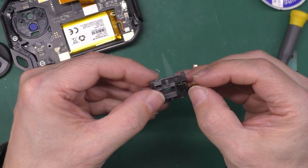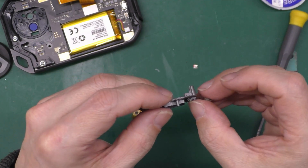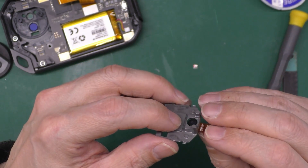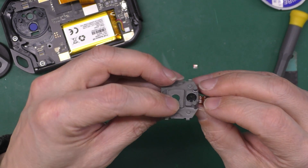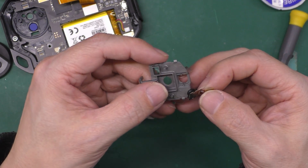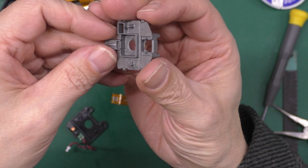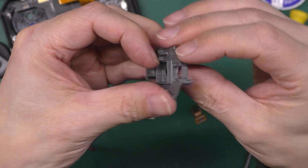It just sits in there so I really just need to tilt it by quite a bit. I almost just need to file this hole there to slightly elongate it so that the sensor can sit at an angle, propped up at one end so that it sits squint. I think I'll do that — I'm just going to take a little needle file and file in there just to give the sensor a little bit of room to play. There we go, just filed it a little bit — you can just sort of see inside where I've been filing.